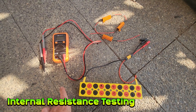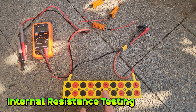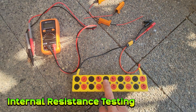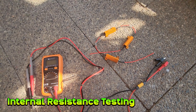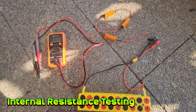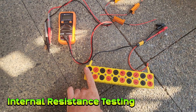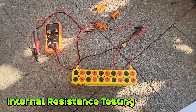This is what I'm using to test the internal resistance, with the 36-volt pack. I'm using these load resistors which are 50 watts, 6.6 ohms — three of those in series for the 36-volt pack, and just one for the 12-volt pack. Basically I'm passing current through them, measuring the voltage before and measuring the voltage drop, and I'll show how I'm doing the calculation to figure out the internal resistance of the wiring and the braid based on the known internal resistance of the cells in the battery.